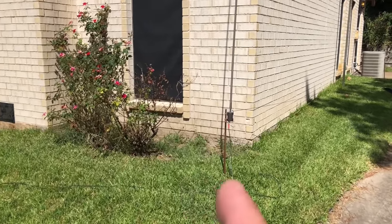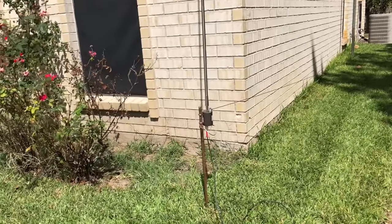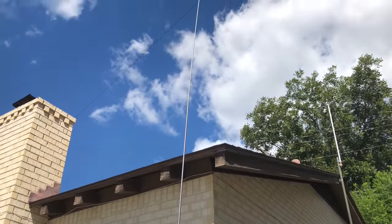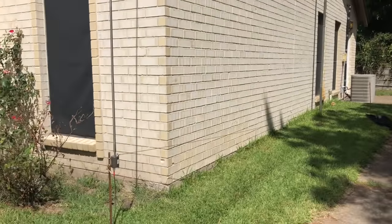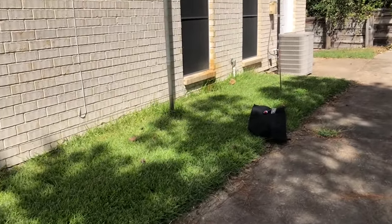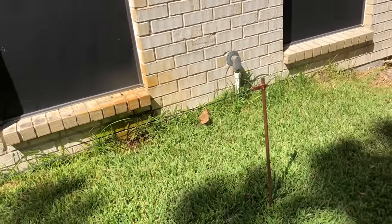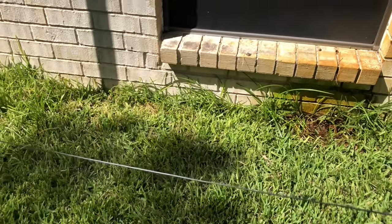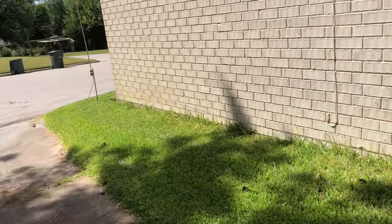Take a look at this. This is the antenna right here. This thing is so small, compact, portable — 17-foot whip. This is my garden, my side yard. I don't have anything. I can't put a vertical with radials out or anything. It's just got two copper pipes you pound into the ground. You've got another radiating wire — this is not a counterpoise, it's above the ground. Super stealth. You can set it up if you just want to play a little bit of radio. It does 80 meters through 6 meters, no tuner needed. It is amazing.